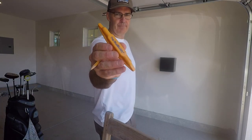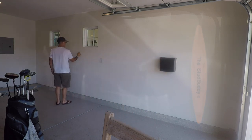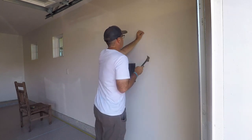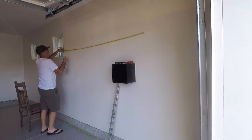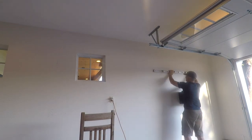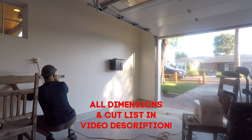The first thing I'm going to do is use this Stud Buddy — that's the stud finder I'm using. It has a magnet inside that attaches to the drywall screws in the drywall. I take my four-foot level and draw everything out on the wall. For long measurements, I throw up a nail to hook my tape measure onto for more accurate measurements since I don't have an extra set of hands.